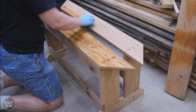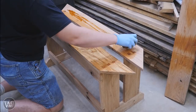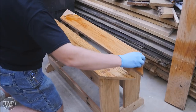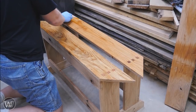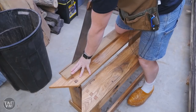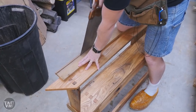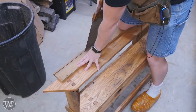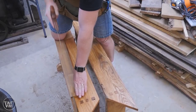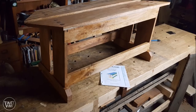For a finish on this, I'm using Waterlox — the same thing I used on the dresser — putting it on with a wool sock, which works fairly well. Waterlox is perfect for this: it's a fairly quick and easy finish, and I love the color it brings out in the white oak. You can use just about any finish you want — it's just a shop bench. Here you can see how it works: you hold it with your knee and your hand, and it's approximately the same height as a chair, so when you're bending, your other leg is fairly straight. It makes rip cutting a lot easier with a handsaw — fairly straightforward and just a lot of fun. I'm very pleased with how this came out and looking forward to years and years of use.